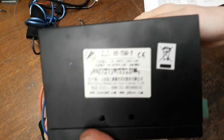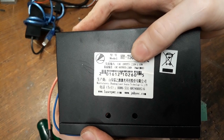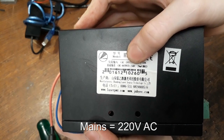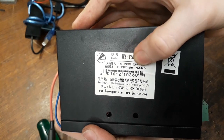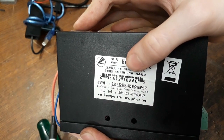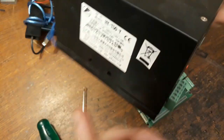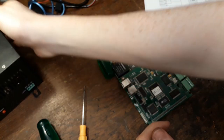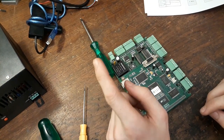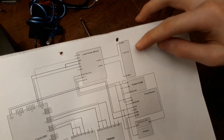I think you may be able to read this. The input is just about mains, and the output is 25 kilovolts at 20 milliamps. So it's crazy high voltage, but not a lot of current. This is actually what the laser tube is going to need for lasing.